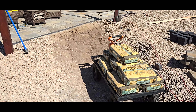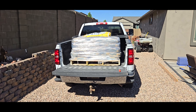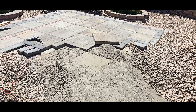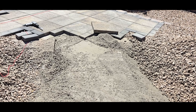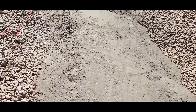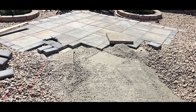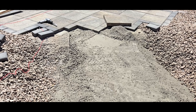We've got cement and a whole bunch more in the truck, so we're set to get started. Since we're putting pavers on top of this, we put in one paver so we'd know exactly how wide it was, and then we have the little 4x8 pavers going down the sides. We need that width plus 4 inches plus a little bit of overhang. Down at an angle on the sides, that'll provide strength so it won't fall away or break. In Arizona we don't have to worry about a freeze line in the ground, so this should hold up just fine and should not need an expansion joint.